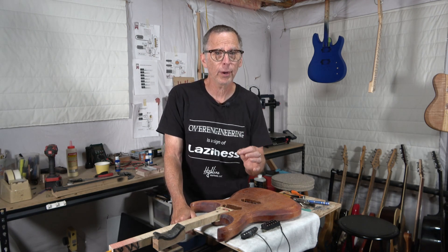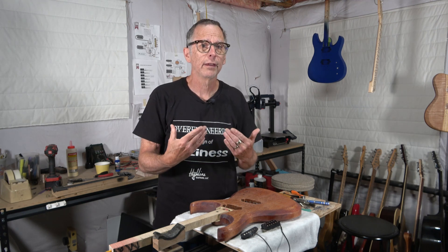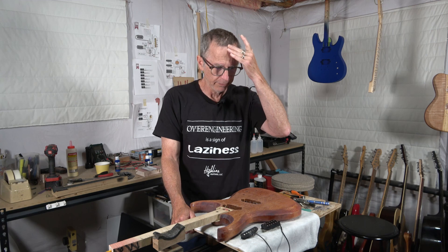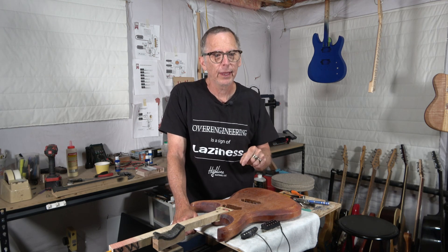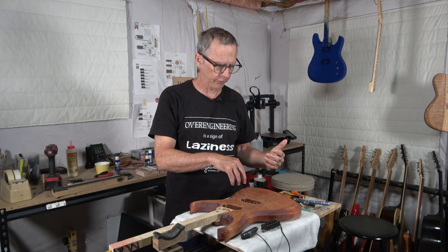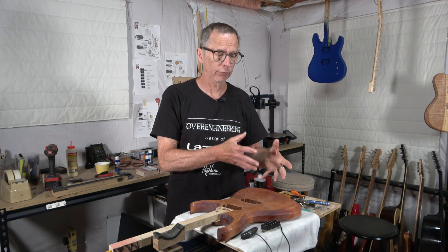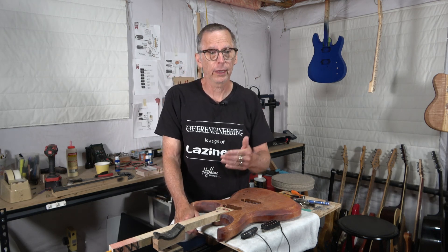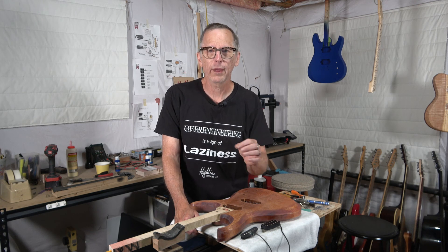The capacitor that is soldered to the tone pot does affect tone. Like the tone pot, the capacitor has a wide variety of different values that will affect the way in which it bleeds off treble as you turn the knob. That's why sometimes when guys have guitars where the tone knob doesn't seem to be doing anything, a simple change in the capacitor value can alter that. Once you have some experience, you'll understand just by reading the value of the capacitor what effect it's going to have on your tone.